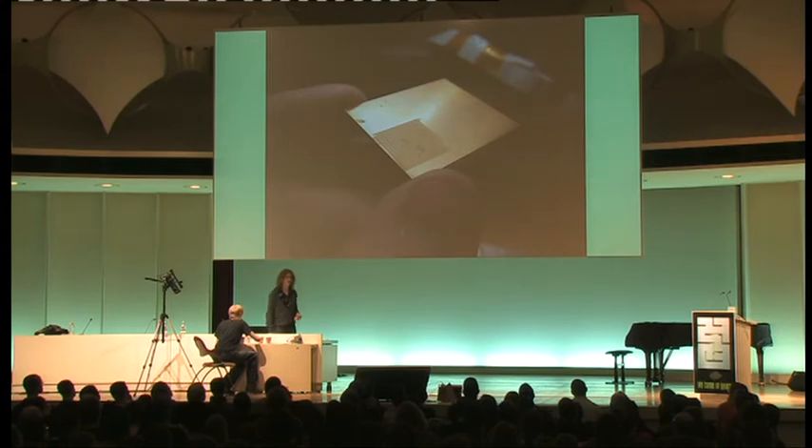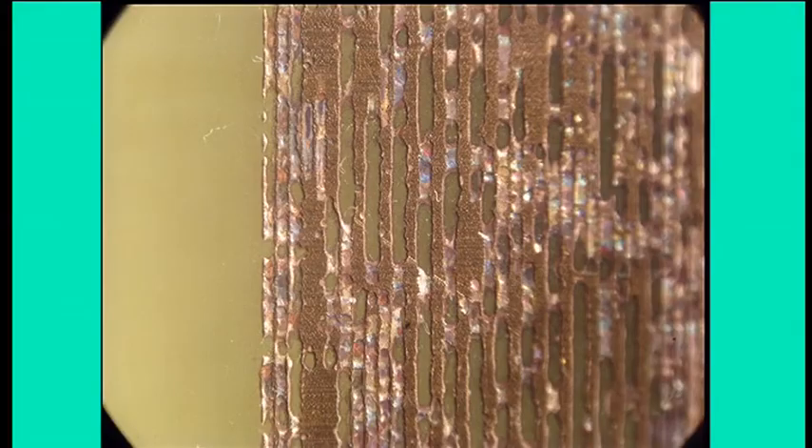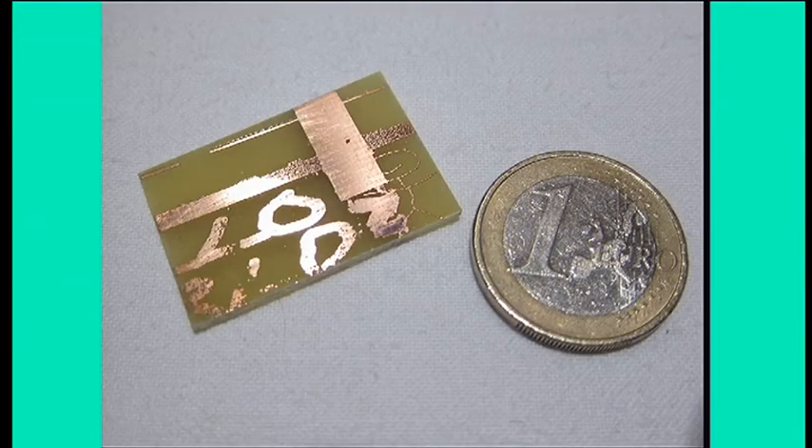This is one of those stacks really close up in a focus-stacked image — a composite of images at different focal lengths. It looks like an icicle: one complete piece of wax with a blobby look, but those blobs aren't individual droplets — they're a kind of freezing zone. The hairs coming out the sides are closer to the scale of individual droplets, so they really are tiny. There's potential for pretty high-res 3D printing, but we want 2D circuits. I started trying to print a large patch of wax and then etch it into copper — it's a load of lines printed very densely — and after etching I was really surprised they came out almost as individual lines. These lines are about 0.05 millimeters wide.